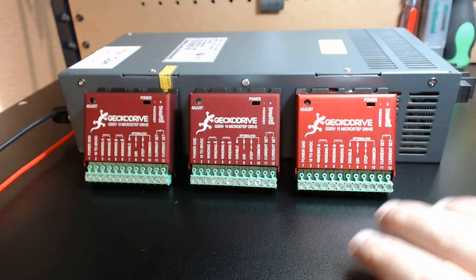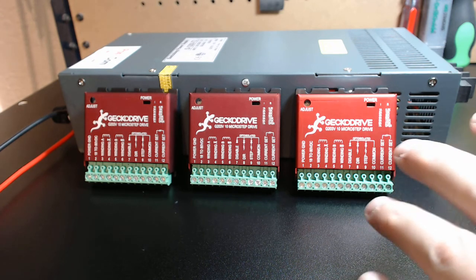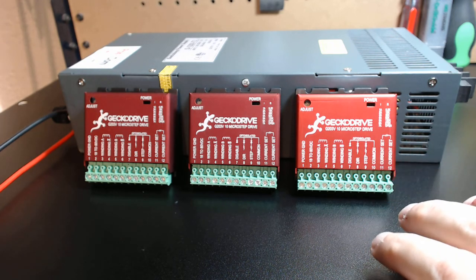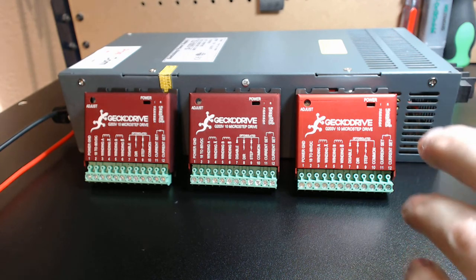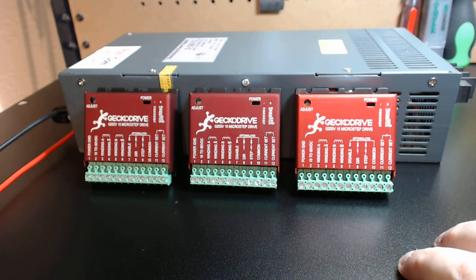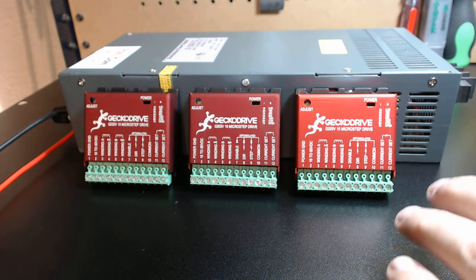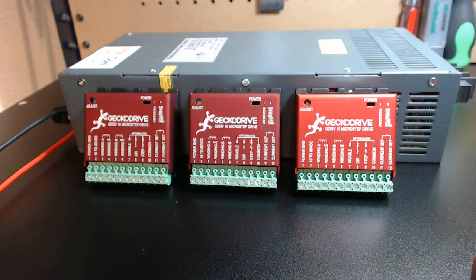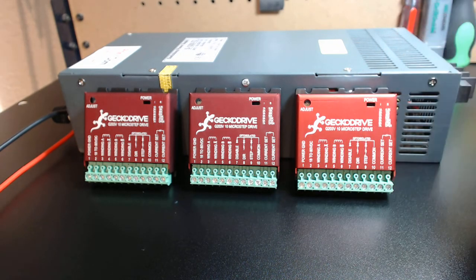As far as comparison to the G540 — I've done a previous video on that. The G540 itself is an amazing system, and for general system use I'd say it's probably top of the line. You're still using 48 volts, getting digital stepper drives and micro-stepping. But if you really want to go to the top of the line in terms of speed, performance, and productivity, it's about a 50% difference as far as your rapid motion. This is the package to go with.